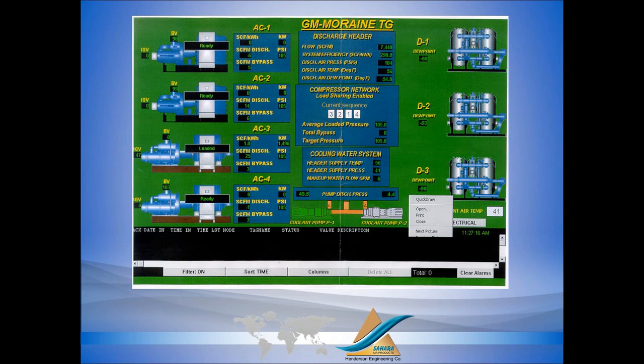Again, I go back to this slide at General Motors because when you have multiple compressors and multiple dryers, you can manifold the compressors and the dryers together. The consideration is making sure that you have equal flow distribution across the dryers. You don't want the flow of four compressors going into dryer one and nothing going into dryers two and three. So you put throttling valves, basically a butterfly valve, in front of the dryers that you can open or close and measure pressure drop and flow across the dryer to make sure that you have equal flow across all dryers. Air will take the path of least resistance. So if you have a shorter run of pipe from the compressor manifold to dryer A, more air is going to go into dryer A. So you always want to make sure that the flow is equally balanced.